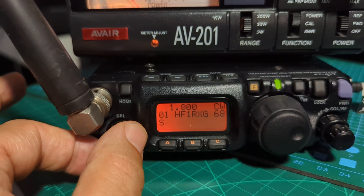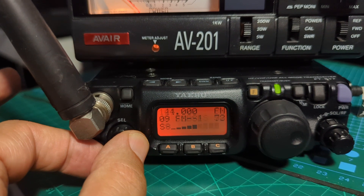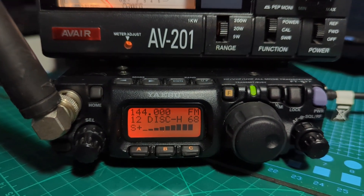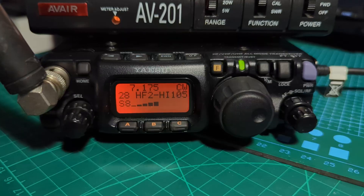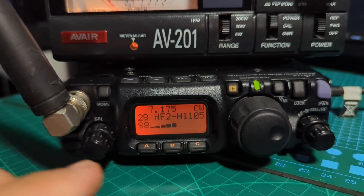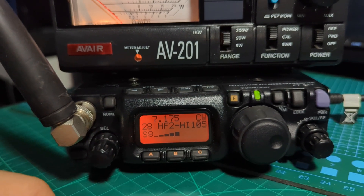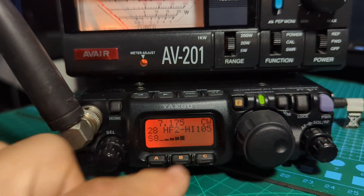In the settings menu you're looking for HF. So we're going to turn it until we get to the menu where we can increase the output power — and it is done per band. In this video I'm just going to do 7 megahertz; you can see 7.175. All I'm going to do is up the number a little bit and see if I get it to 6 watts.